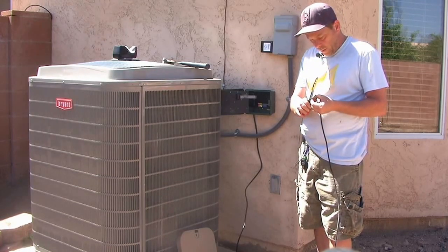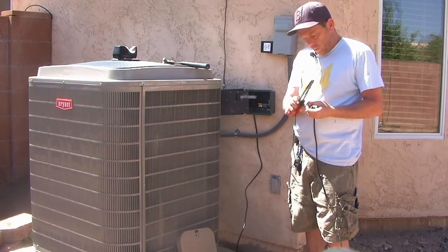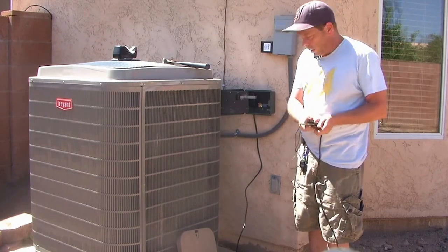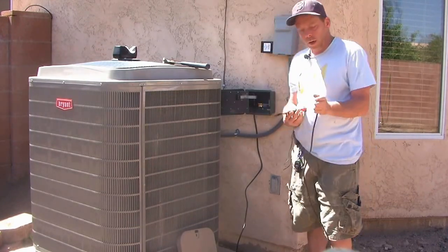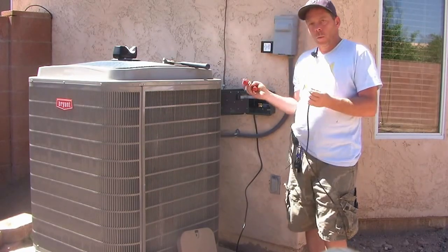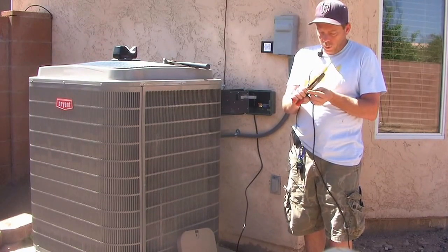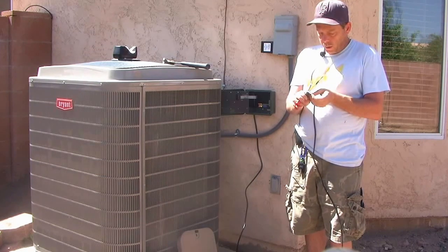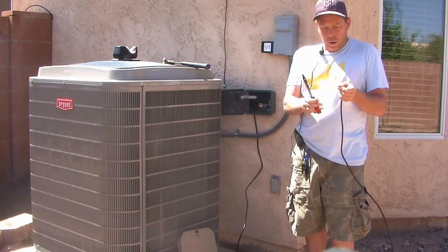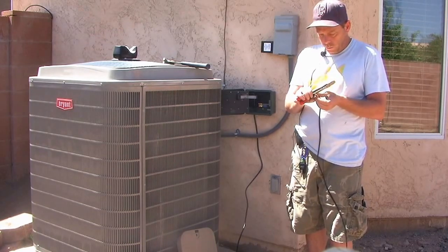One of the things I recommend to folks is when you set all this up, write down notes of what color wire runs which circuit. That way, if you have to come over here and mess with things, you know that number one is green and it runs the lawn. So that when you're going to go reprogram your timer, because it's winter time or because you've added some new plants or something, you won't be standing there confused wondering which valve is which.